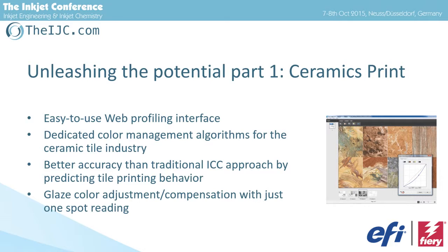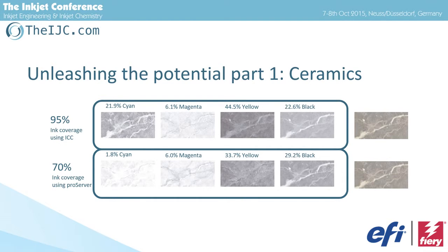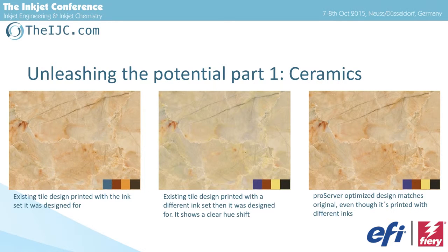This is dedicated with algorithms for the ceramic tile industry, with much higher precision than ICC offers today, because ICC profiles cannot deal with glaze in non-uniform areas. Plus, everybody wants to save ink — especially in the ceramic tile industry. I want the cheapest ink and the lowest ink consumption. What we have here is basically getting the same output with 25% less ink coverage. In addition, when we look at the print bars — and you can see the physical samples out there — they change inks from one day to the other, but then have to reproduce a job from last week with a different ink. No one wants to clean the machine.